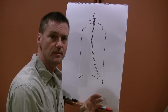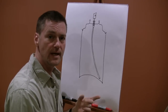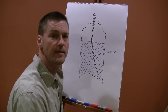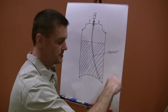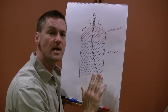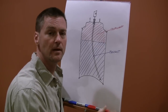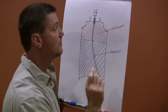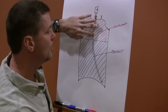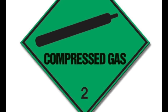The chemical propulsion system consists of two things: product, which comprises about three-quarters of the can, and propellant, which lies in the headspace. Now there are two different types of propellant: inert gas and liquefied gas, which is more commonly used today. But the mechanical actuation of the system remains the same for both — when you press the actuator, all of this remains the same regardless of what type of propellant you have.